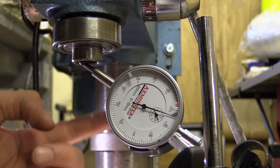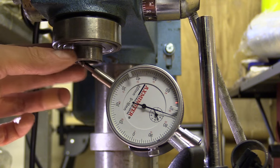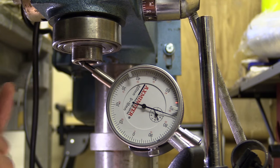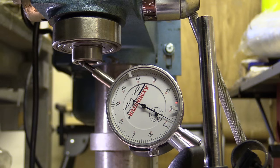I've also just fixed the back of my dial gauge which broke. Now I'm going to check the Morse taper again — it's about 0.02mm to 0.03mm, which is very similar to what the model I returned had.